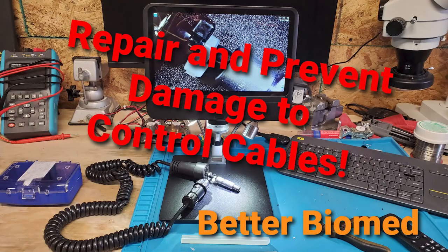That is pretty much it — that is a completed fixed cable. And it's not just for this type of cable; you can use these techniques for all sorts of things. Just remember to keep the glue hot, keep it rotated, and blow it towards the connector. When you're finally done, before you plug it into the table or microscope or whatever you're doing, make sure you check the cable with an ohm meter to make sure there's no continuity between any pins. If there's continuity between the pins, you've got to do it all over again — or give up on that cable. Check your cable before you connect it to a medical device to make sure you have no continuity between the pins. Thanks for watching, guys. I hope this was informative. My first time using a digital microscope, and although the video is a little shaky, it really allows me to show you guys in detail what it is that I do and my technique.